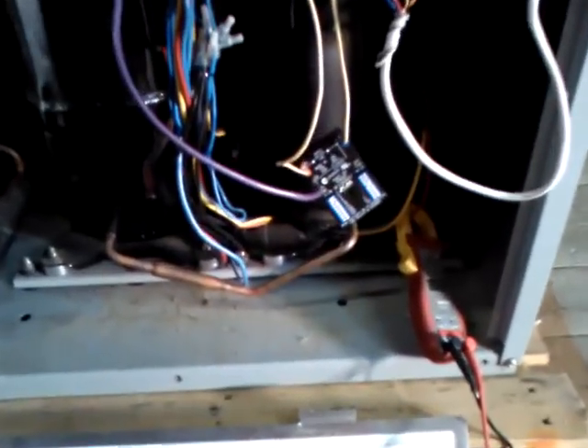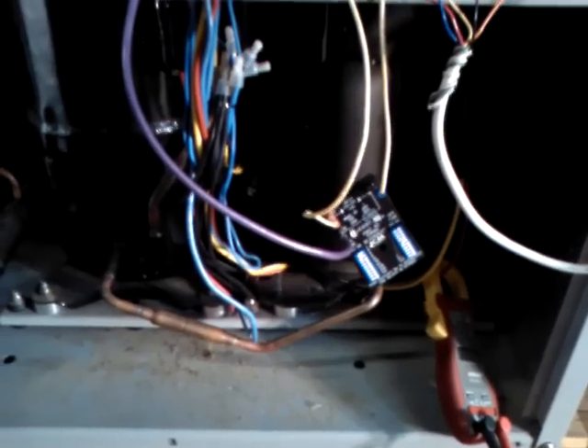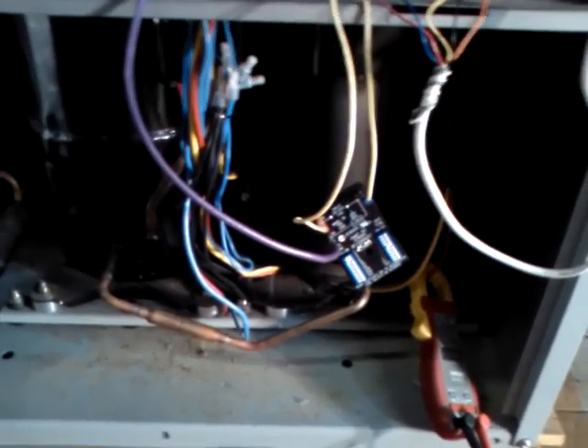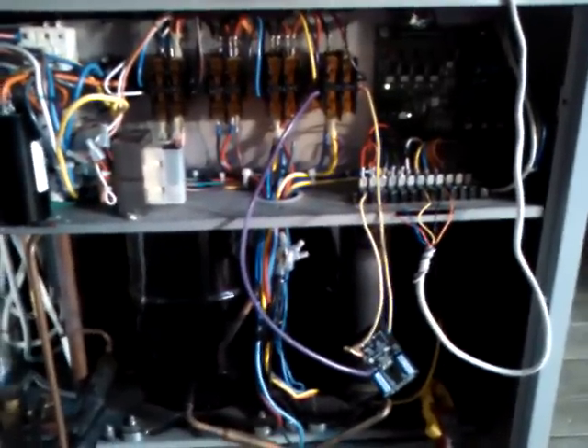What I'm using here is an ICM sequencer. ICM has been fantastic in getting me a potential relay — the UMSR-50 — to test, and a sequencer to really put this system through an absolutely gruesome test. What I'm doing is running a 3-second on, 16-second off cycle.